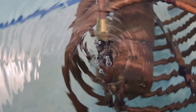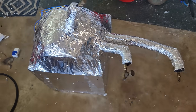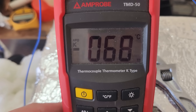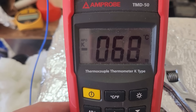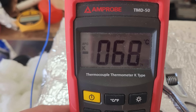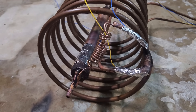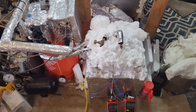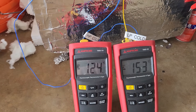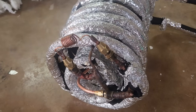After resolving some leaks by reflowing my braze joints, I wrapped the tank and heat exchanger tubing in foam and placed the whole assembly in a thick foam box stuffed with fiberglass wool. Problem was, with the big tank the system never got below around minus 68°C — the thermal inertia of all that copper was too much, or it wasn't insulated well enough. So I switched to a much smaller tank using a one-inch pipe instead. I also tried expanding foam as insulation, but it had a bunch of air pockets and only got down to minus 153°C. So I busted up the expanding foam, wrapped the heat exchanger tubing with rubber foam, and stuffed everything with fiberglass wool.